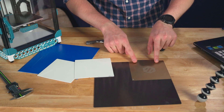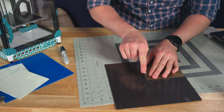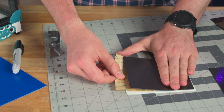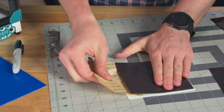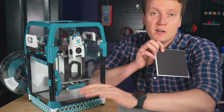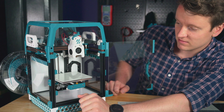I'm using the spring steel plate as a guide since it's the correct size and sticks to the magnet well, making scoring really easy. When peeling the 3M adhesive off the back of the magnet, do a little section at a time, moving along and pressing it down firmly as you go, making sure there are no big bubbles underneath. It doesn't need to be perfect but being careful helps. The magnet doesn't fully cover the edges but is large enough to cover the entire surface for full adhesion. Installation is a breeze — magnets are great, they hold everything in place, and it looks great.